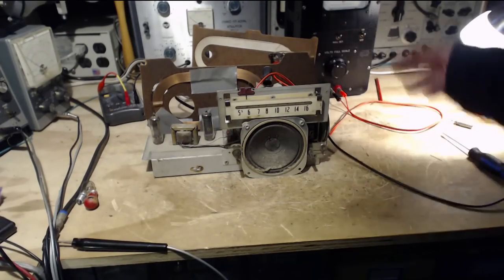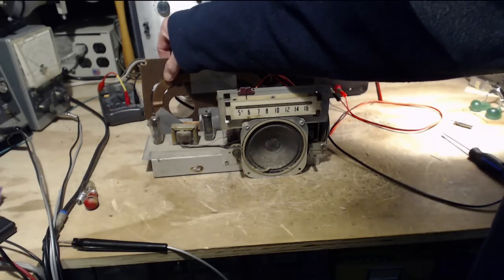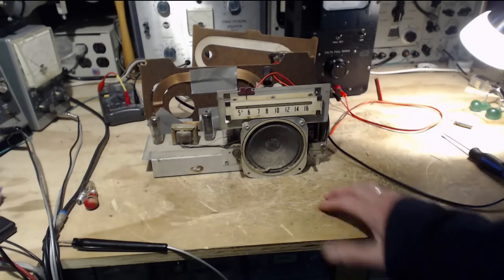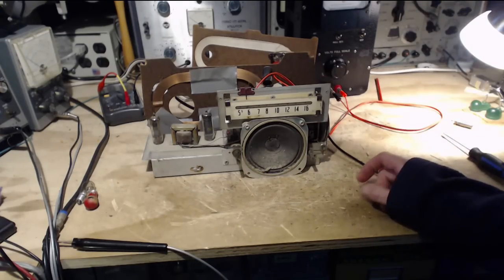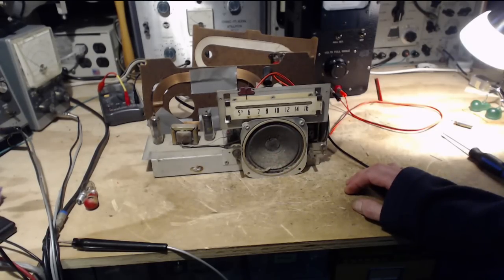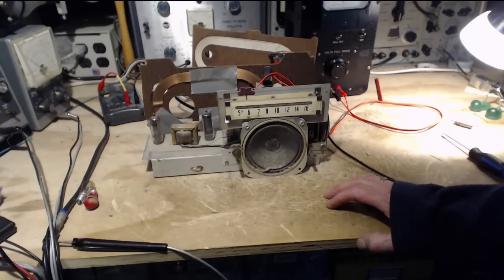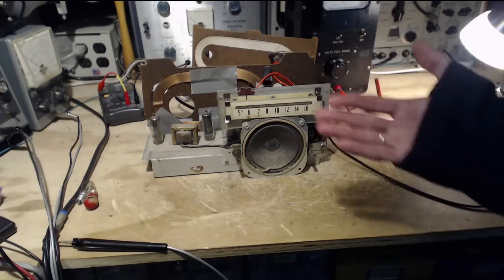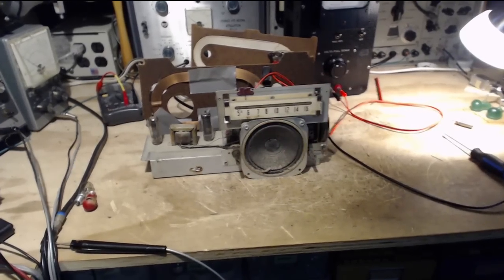It's really working well. It's working as good as you should expect for a radio that has this type of antenna on it. The last radio I finished was a music box radio, even simpler than this one, and all it used for an antenna was a length of wire, and that's really bad. So that radio, you can't expect even this kind of performance. So that's great. If you have a radio with six tubes in it, and the first one is an RF tube, and you have another whole stage in the front of the radio, you get the next level up from this radio, which means it would probably pick up those stations without much interference at all.